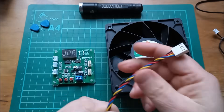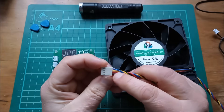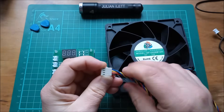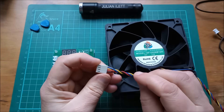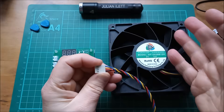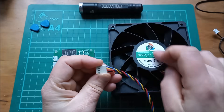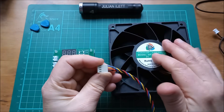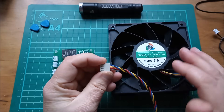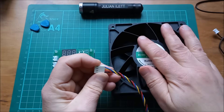This is a four wire fan. The four wires are: black is ground, red is the positive supply for the fan — generally 12 volts, this one does say 12 volts. Yellow is a tachometer signal; it's open collector, so every revolution or maybe half revolution it pulses low, pulling the yellow pin low. The fourth wire, blue, is pulse width modulation — a five volt PWM signal which controls the speed of the fan.